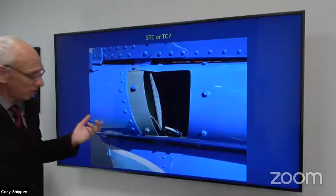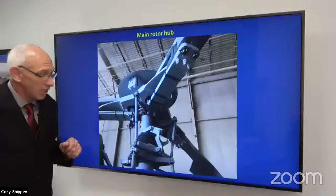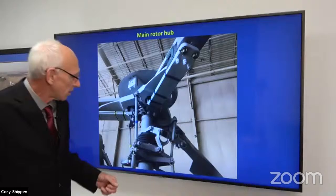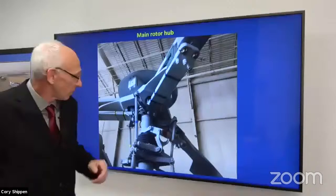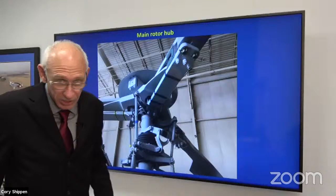And this is just a close-up showing you what we just saw. All right. This is the main rotor head swash plate. We can see a lot of things here. The blue section here, typically we won't have balance weights on that because we have the rotating scissor assembly here. So that's a heavier part of the rotating mass.